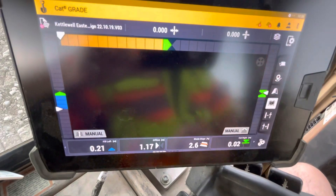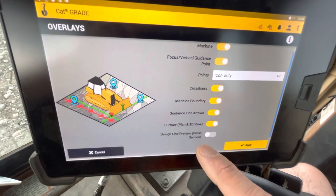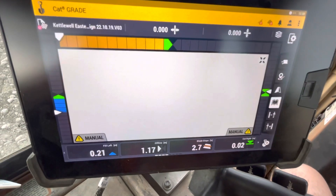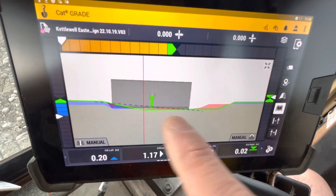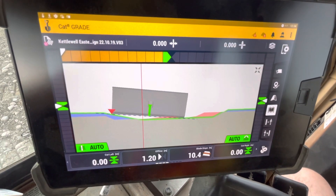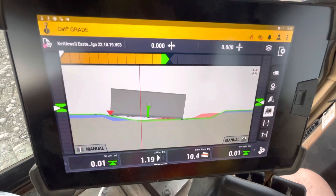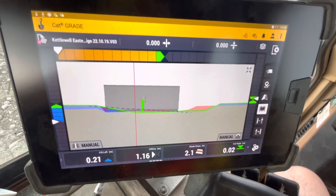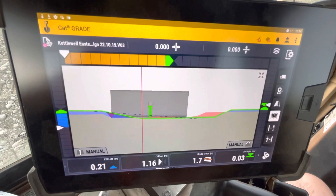You can come into this overlays menu and scroll up, and there's the design line preview. If I turn that on, this is actually where the cut and fills are getting generated to — you can see the dashed blue line there. So when I go into autos the system's doing the right thing — it's going to that dashed blue line — but that's not what I want. I actually want it to stick flat to the bottom here, and I'll come back and use some of the excess material to form that slope later.